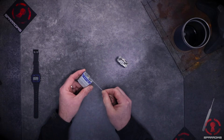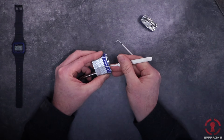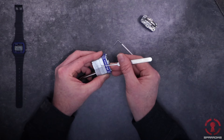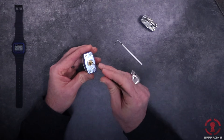As you're lifting that pin — let's call it the hard one — it's dragging inside the shell. As you get it lifted to the right spot, you'll feel it stop a little bit. That's because it's hitting the shear line inside the lock, which lets the cylinder turn ever so slightly.